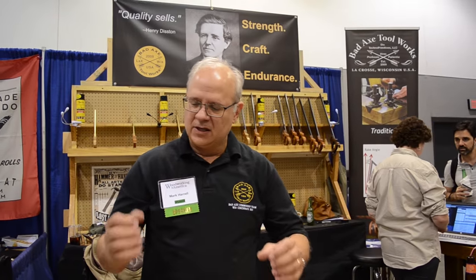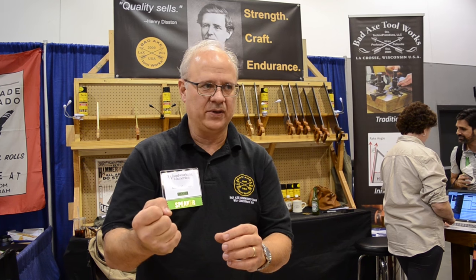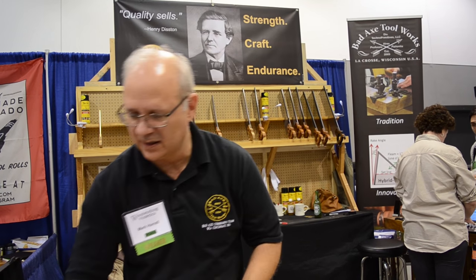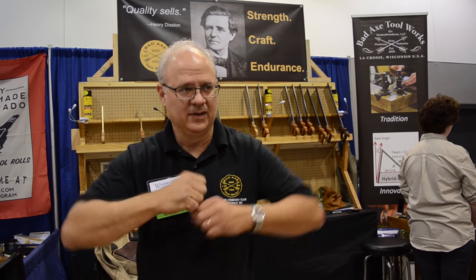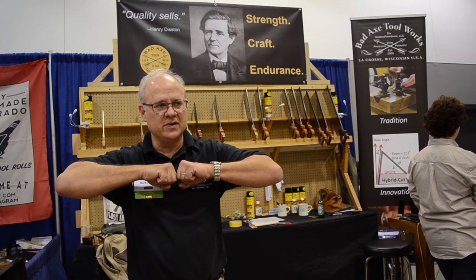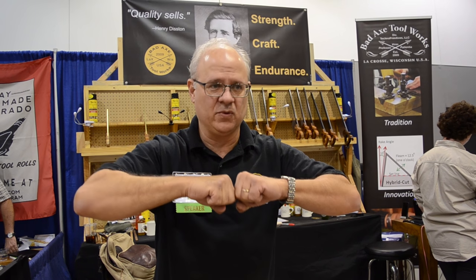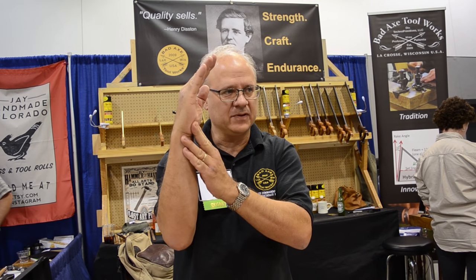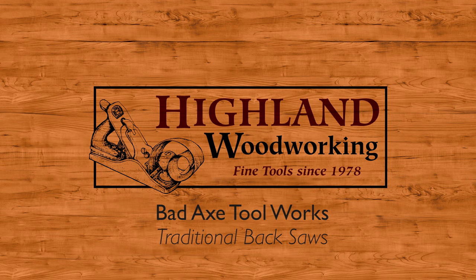What's the difference? If you've bent a tooth in place with a pliers set, you're not just shaping the tooth — you're also distorting the metal in the gullet. There's a little dimple. That's kind of like walking through the crowded streets of Manhattan with your elbows stuck out. You're inviting more friction into the cut. But if all you're affecting is the upper half of the tooth, you're going to have an incredibly consistent set that will help your saw cut like it's on rails. Your ability to take ownership in maintaining your saw just keeps it cutting like a beast.